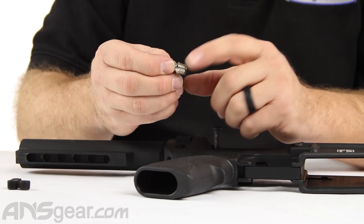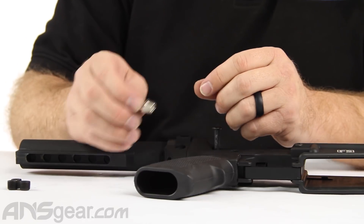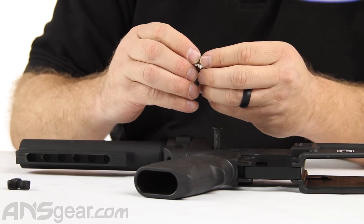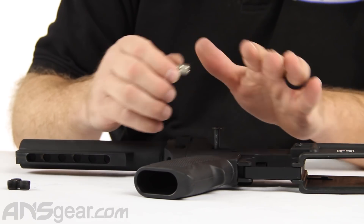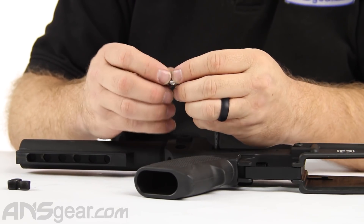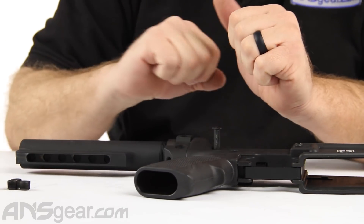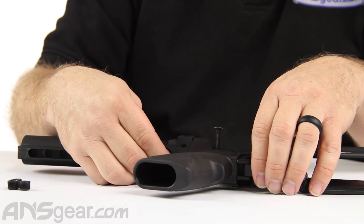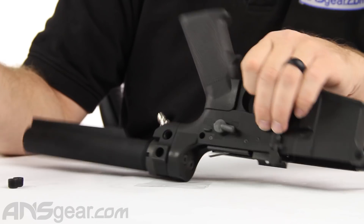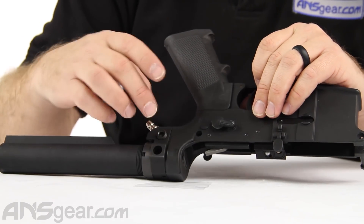As far as putting these fittings on, they all need to be either Teflon or Loctited. If you are an instant gratification player and want it right away, Teflon is the way to do it because Loctite will take too long to set up. I do not recommend white Teflon — the plumber's Teflon. It's too stringy, it breaks apart too easy, and it will blow through your gun and cause problems. Get the gas-fitting Teflon — it's a yellow Teflon. It's thicker, holds up better, easier to work with, and it's just better all around. Put some on there, then put the fittings in — it's very simple.